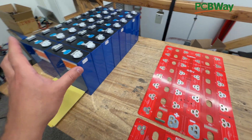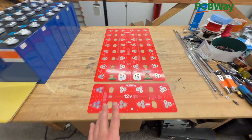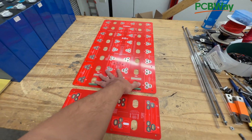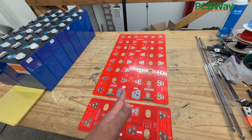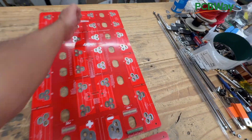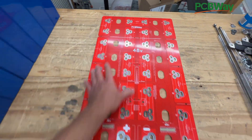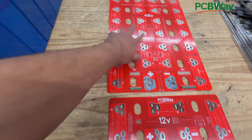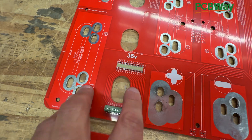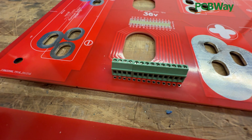Before we start designing from scratch, the easiest thing to do is use what we have. We have this 48-volt version — 16 cells in series — and all we have to do is cut this in half, move the negative terminal, and then reroute the traces. These are trace fuses, and these are traces so you can run balance leads into these connectors using a set screw, allowing you to easily install your BMS.